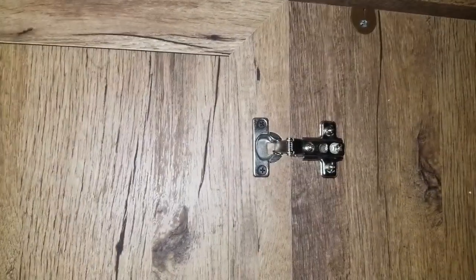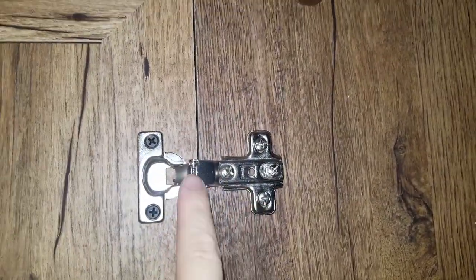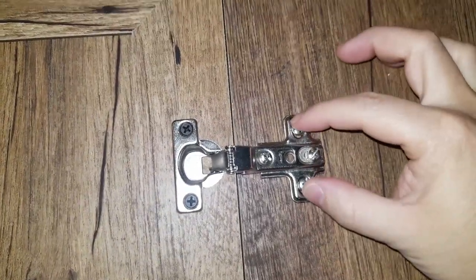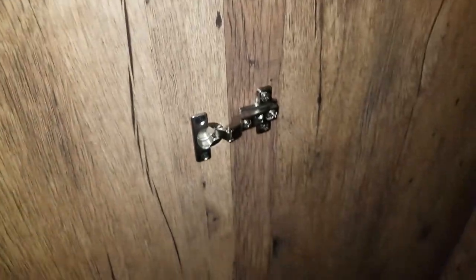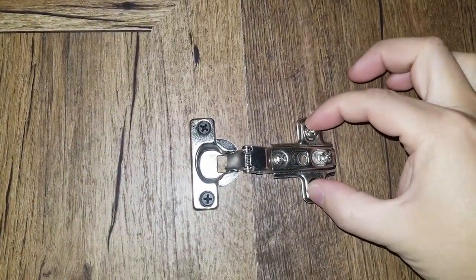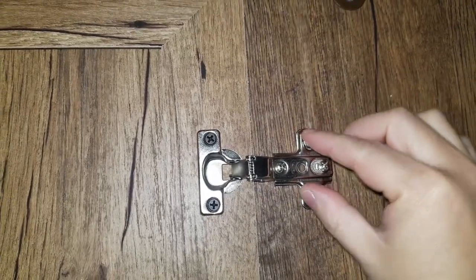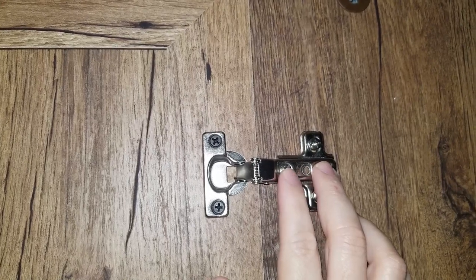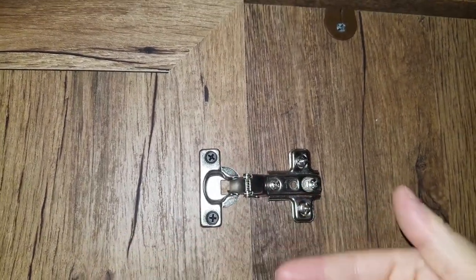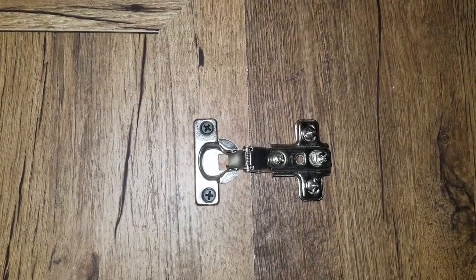A couple adjustments you'll have are on the doors and on the drawer down below. These are the hinges used at the doors to adjust them up or down — it's these two screws here. There are three hinges per door so you'd have to loosen all six of these, move the door up or down, and then tighten it again. Loosen this screw and you'll have to take the pressure off of this one also, but this screw brings the door back and forth — how far away you are from the frame of the armoire.